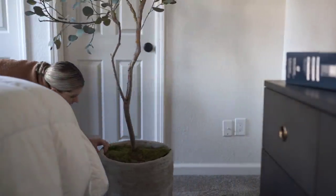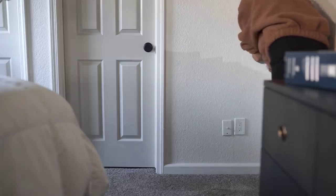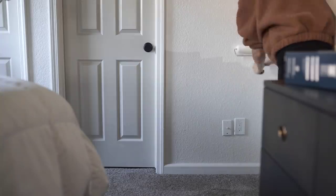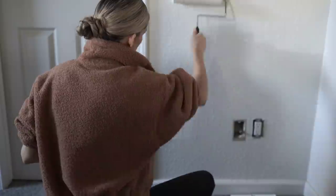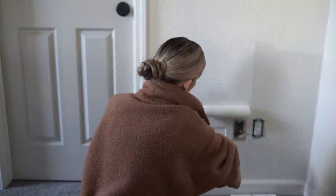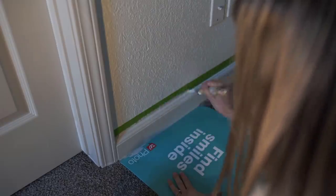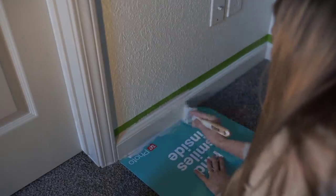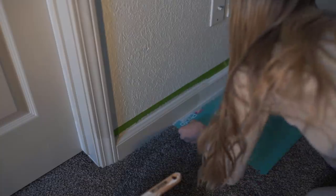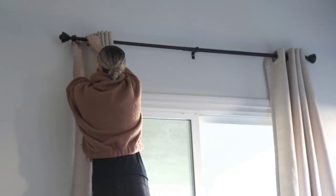I DIY'd this tree last week and I have to move it out of the way — it's going to stay in this corner, but I need to move it to paint. So I'm going to be doing the walls in Alabaster, and I want to do the doors, the trim, and the baseboards in the Revere Pewter. I masked off the baseboard, and a little trick I like to do with baseboards and carpet is slip a piece of cardboard or cardstock — something that's kind of thin — underneath the baseboard, and you can paint right on top. Then you just slide the cardboard along as you go and you don't get drips or paint on your carpet.